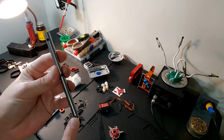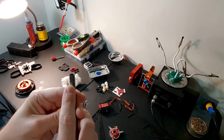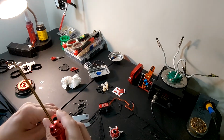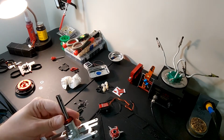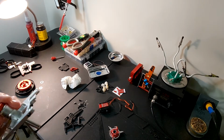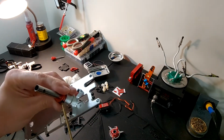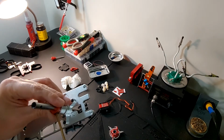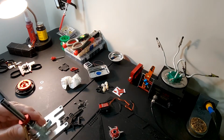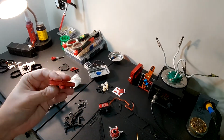So here's the main shaft. This is the bottom of the shaft. You can tell because the hole is so close to the bottom. This is where your head will mount, your head block. This is the collar. Rub screw does not feel like it has any Loctite on it at all, so we will definitely have to put some Loctite on it. So just take it out, put some on it, and put her back in. It looks like there's 2 of them, so one on each side.